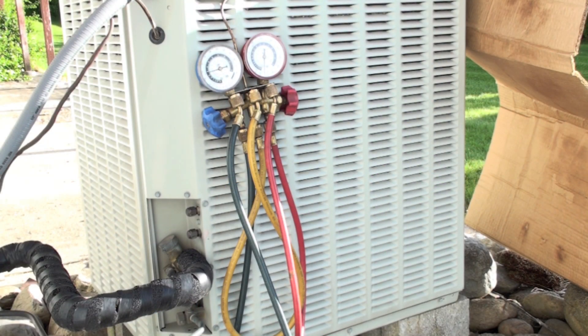On this one we're going to show how you install a gauge set and how you bleed the lines. This machine here is a heat pump, so it's actually got four taps. This is a Trane — a Trane likes to have four taps.